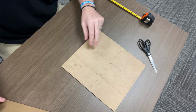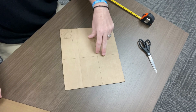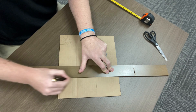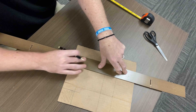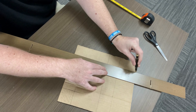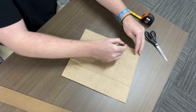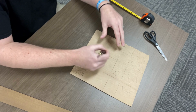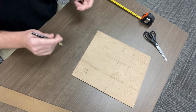I've scribbled out the section I'm going to cut so I don't get it confused with any other sections. Keep this in mind: I've come up two inches here. So here's my six-inch line — I'm going to come up two inches there. I'll take my straight edge again, line the inside edge, and trace the outside edge. Then I'm going to cut this out. This will be labeled 'top' and this will be labeled 'side,' just so I remember that as I'm using this template on my windows.